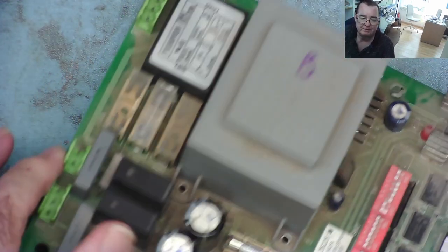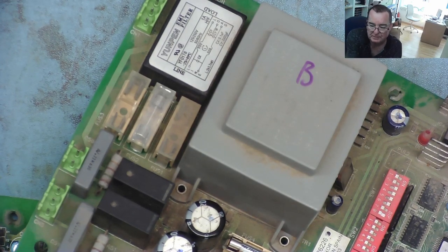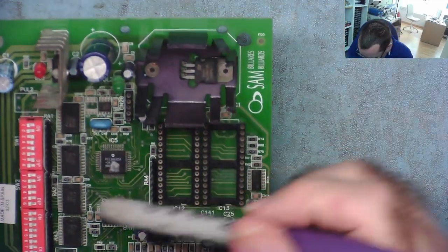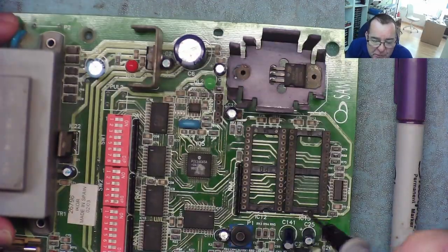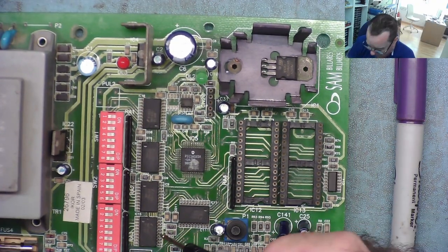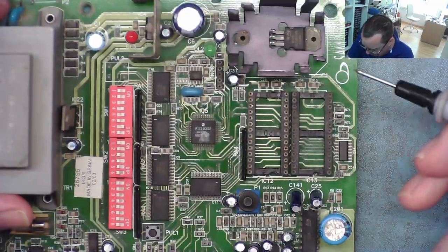These two boards are very dirty, so I'm going to put them in the sink, let them have a good dry, and then let's see if we can be more conclusive where the problem is. I've let the boards dry overnight, so it's a different day today, different t-shirt. It looks cleaner now, but there's definitely some sort of corrosion in it here. And we know for certain that there are some pins which are not connected, like some sort of track problem on this.